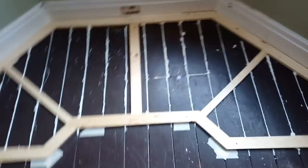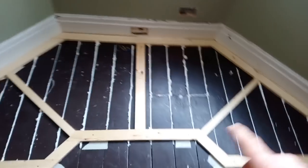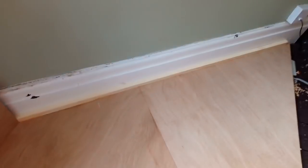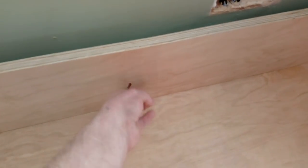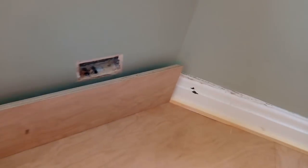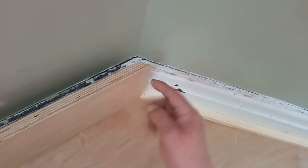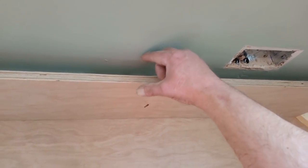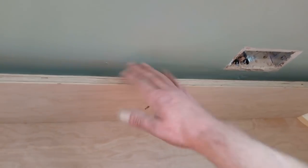Put a box on the front. Screwed it down. Ready to put that back on. Put a 20 mil batten all round. Cut this board one way around. Don't matter about that. What I'm going to do is just start lining it out, cutting the corners. This one will run in there, get a few pins in it, plenty of glue. Put the batten on the edge so that this comes out a bit more, so when I get a 3-inch timber on the top, I've got something solid to fix to.